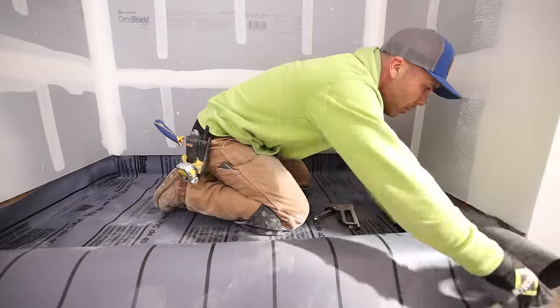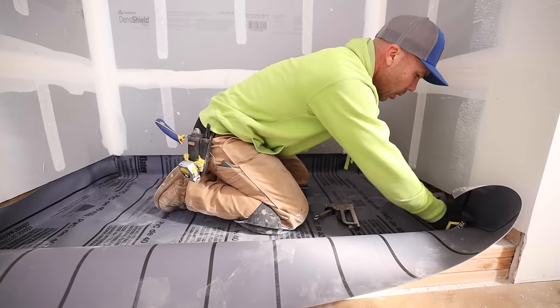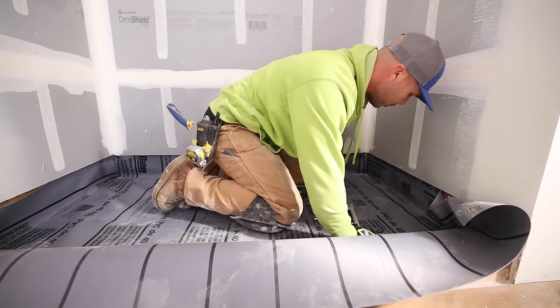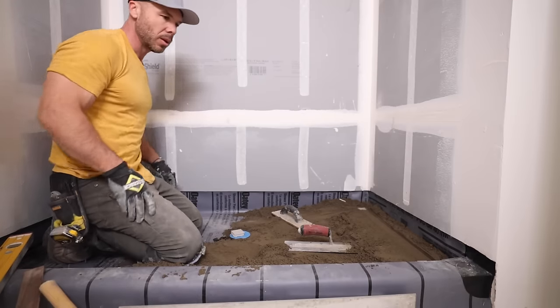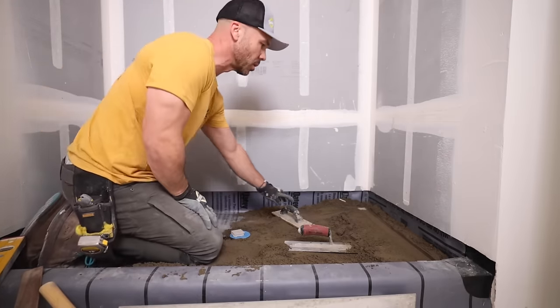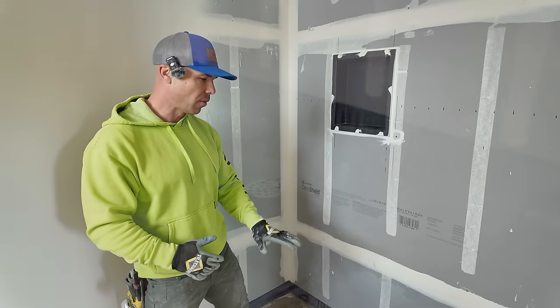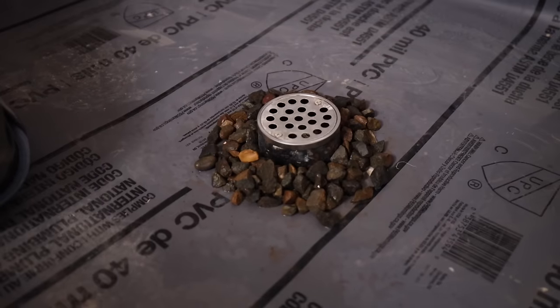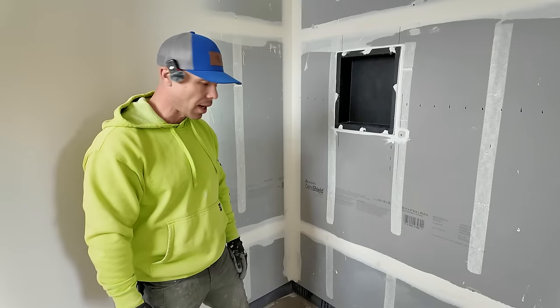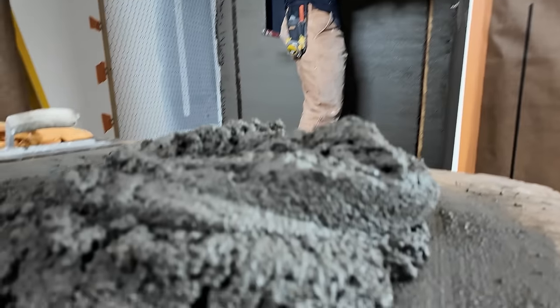Day one, we got the pan liner in. If you wanna see that video, I'll put a link in the description. Day two, we came in, we floated the mortar bed on here so that the mortar bed is all ready. This is a water in, water out system. We're not gonna put any topical waterproofing over the float. Everything is designed to go down and drain through the weep holes of the drain if water gets down below the tile. We're gonna be floating the walls.